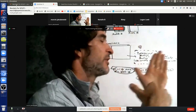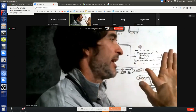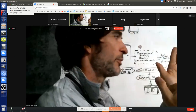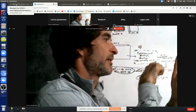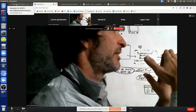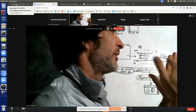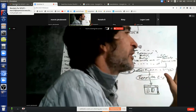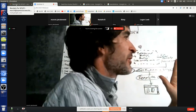You can do that relatively simply. You measure the cross, and what we do is draw a line there, and then from here you have a very explicit distance, and you can draw that distance there. Those two lines will intersect only at one possible point, and that is your absolute perfect square.